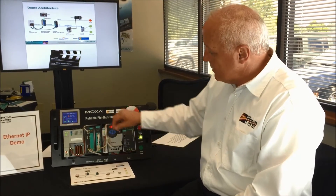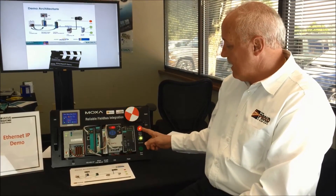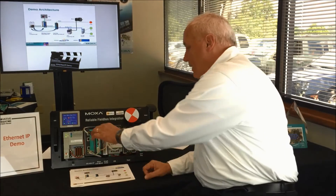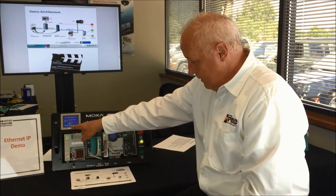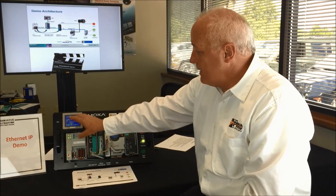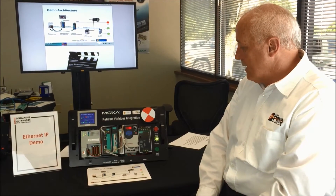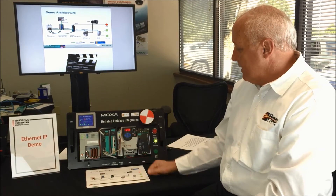So what we'll do now is just show you some of the things you can program. We're going to break the Ethernet to the M-Gate, and you'll see we have an alarm set on the ProFace — it stops the motor, the drive goes to zero. We'll plug everything back in, and immediately over the network it clears up. You'll also see that the EDS-405A integrates on an RSLogix-type interface, so it actually shows up as the ports and everything — you can see you're going right through it. Whenever the PLC becomes happy, it restarts the drive and takes off.